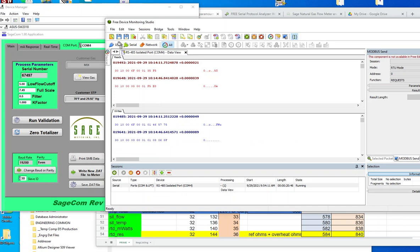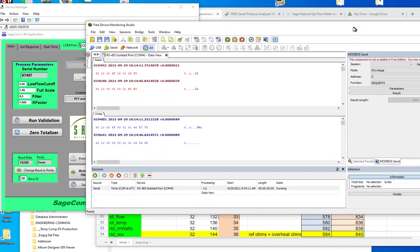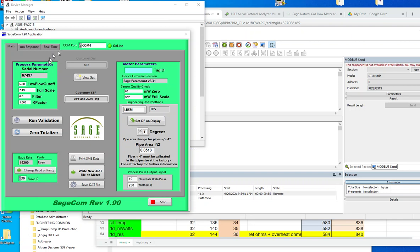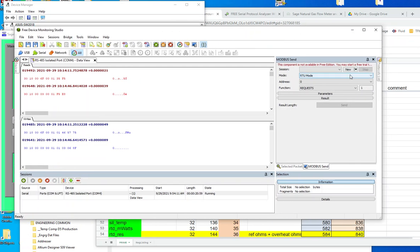We've got the CRCs here. So that shows you there is a sniffer that's viable for LabVIEW or any device that uses — this one is selectable — Modbus RTU. Here are all the different modes including ASCII mode, and there are other modes as well. That is the world's easiest to use sniffer program. We'll see you next time.